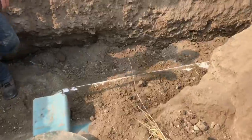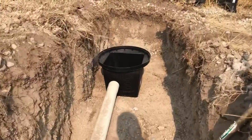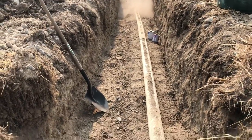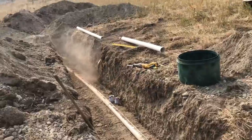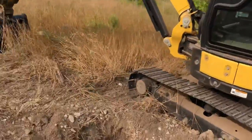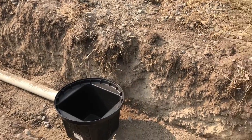As we move down the line, we've got the outlet end of the septic tank — it's a little deeper than anticipated. We've got that line heading towards the distribution box, and because this is downslope, I tapered it off so we're getting less of a slope. You can see the level is rising, so it's not as deep, meaning the drain field won't be buried too far down. In this particular case, I'm going to switch to a seepage bed because we'll run out of space for trenching before reaching the vineyard — so we'll do a long, narrow seepage bed instead.